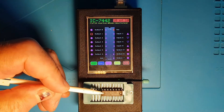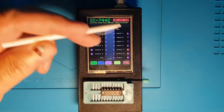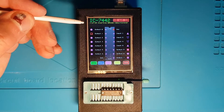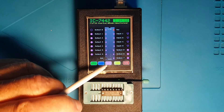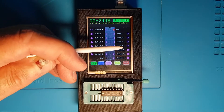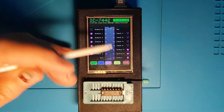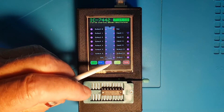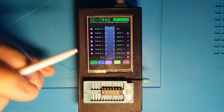I've now swapped in a good 74 42. Since we're already on the 74 42 definition, I can just hit the init button to go back to test one of ten and step through all defined test cases. We're expecting the inputs to climb from zero to nine and the outputs to go low each one in turn from zero to nine. This time with the good 74 42 — that's exactly how it behaves. One good 74 42, one duff one.